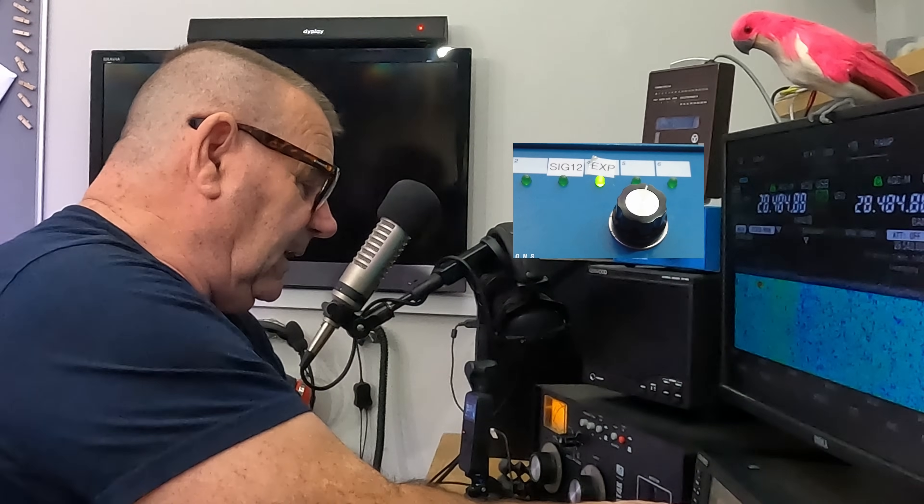Let's find a station on the Signature 12.4 and swap between the two. Switching to the Game Master — I think you saw a couple of S-points difference. Between the two antennas he's about two S-points. SWR on the Signature 12.4 is about 1.3:1, and on the Game Master it's essentially 1:1. Let's go to the 12 meter band and repeat the experiment.